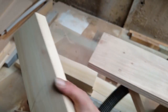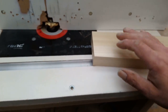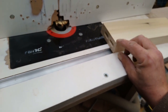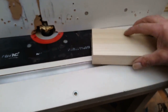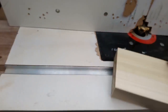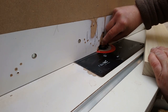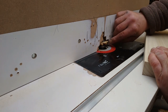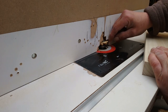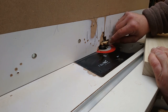All my timbers I'll run through with the faced side down, so if you've got different sized timbers at least all your faces will be flush. And I'll just run them through. You could put a backer board on so just the cut is showing, but I know it doesn't help too much — it helps with the big breakout but this edge always ends up getting burred over so you don't get a perfect cut.